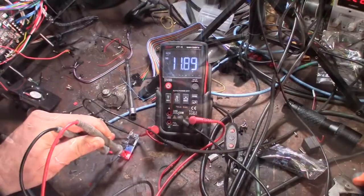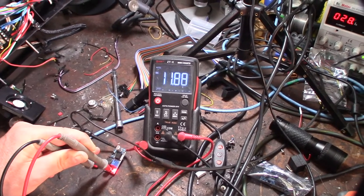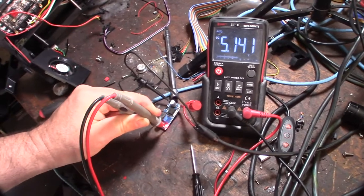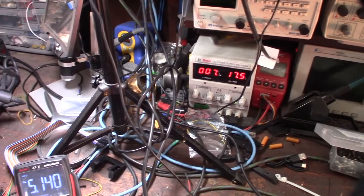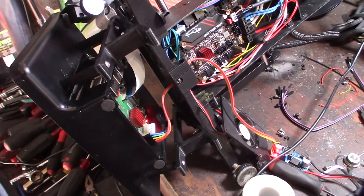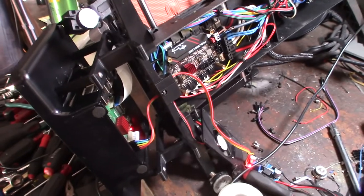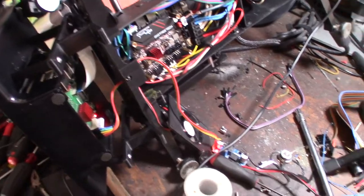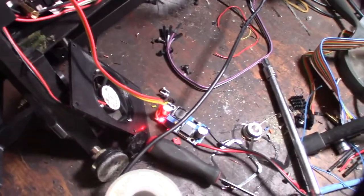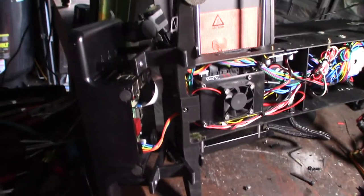This is actually a Raspberry Pi 3, not a 4 - the 4 uses a lot more power. That's originally why I thought I could get away with powering it off the board itself. The 3 uses a lot less power than the 4. I'm going to lower it down to maybe 5 volts - I might just be overvolting it. Now that I've got the back cover on, I like the fact that all my stuff is done over one wire - powered USB, all that stuff. I'll flip that back over.